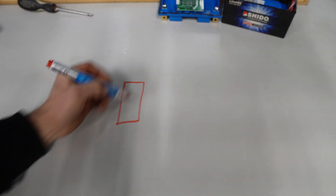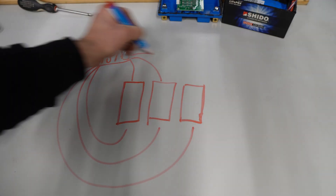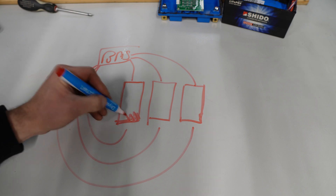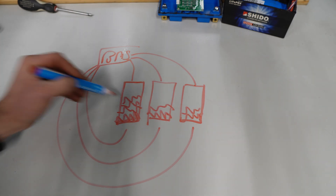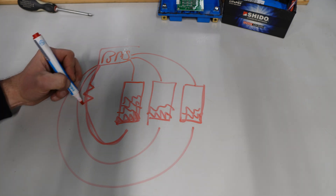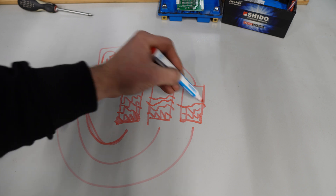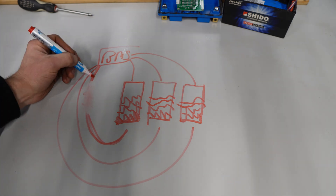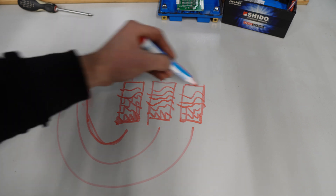The second purpose is to equalize the cells during charging. This is done by changing the resistance of the earth path. As the battery charges, slight inconsistencies in the cells may cause one cell to charge up quicker. The battery management system will notice this, increase the resistance on that cell, and allow the other cells to catch up. Once they're all back to the same charge level, they'll all continue to charge, and it will do this continuously throughout charging.